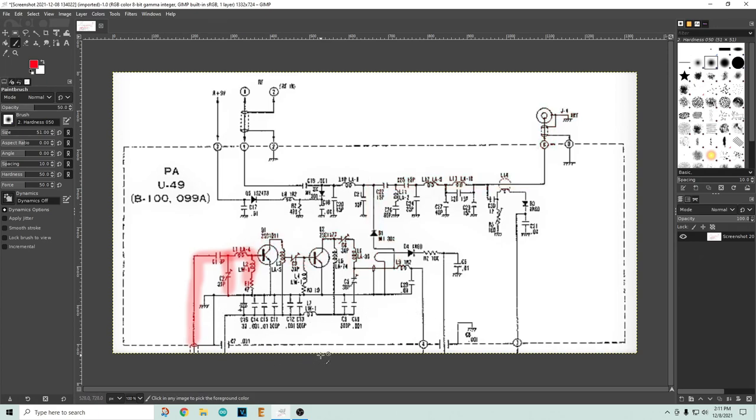We can look at a couple of things here. There are capacitors and inductors for impedance matching along the way. This is pretty easy to understand: the emitter is tied to ground, so a positive voltage at the base turns the transistor on. We don't have to worry about biasing so much in this type of amplifier because it's FM. An FM signal has no amplitude modulation — just frequency modulation — so the power is constant and the frequency moves up and down. You don't need to be in the linear region of the transistors. These are probably something like class C amplifiers.